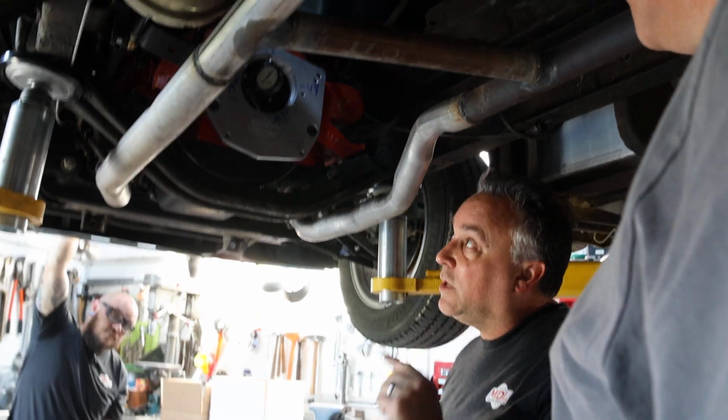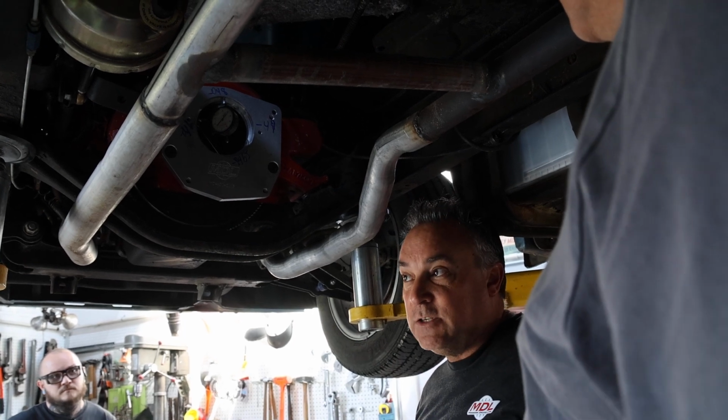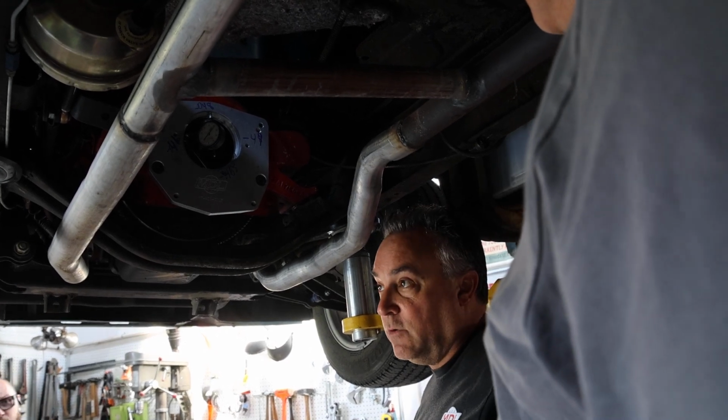You can be allowed up to a total of 10 thousandths on your dial indication run out. You divide it by 2, that's 5 thousandths radial center. That's Tremec's rule. That's what we promote. It's in all of our instructions.